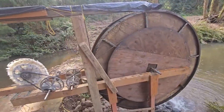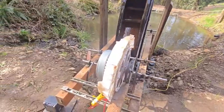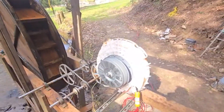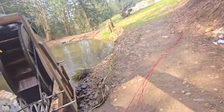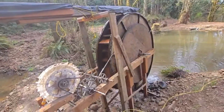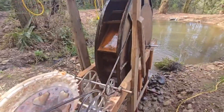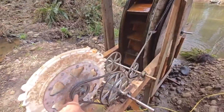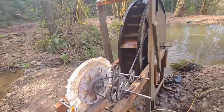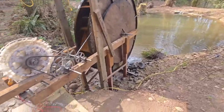So if I can speed that up to six seconds per rotation, we're getting about twelve rotations a minute. Right now, with this thing barely moving, I'm not even getting 300 RPMs. Our ratio is about 35-to-1, so each time the wheel goes around once, the motor spins 35 times. Five rotations a minute times 35 is roughly what this motor is spinning. I just need to rebuild the wheel, which will be challenging since that end is in the pond and this end is pretty tight.